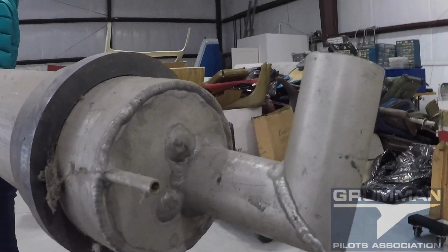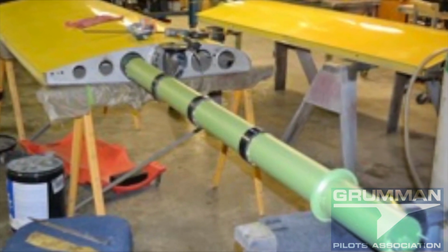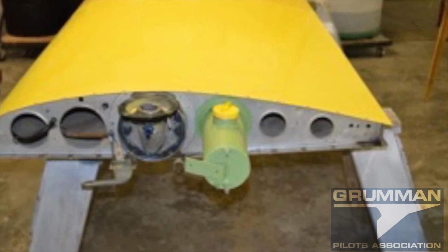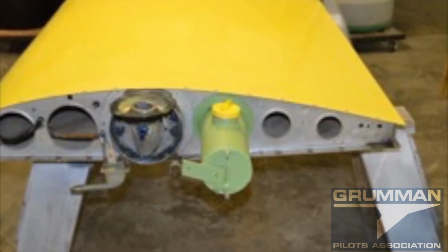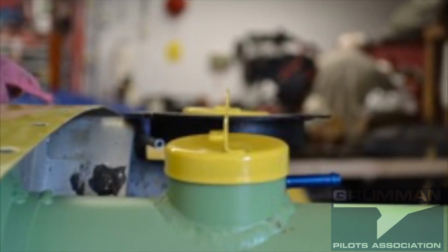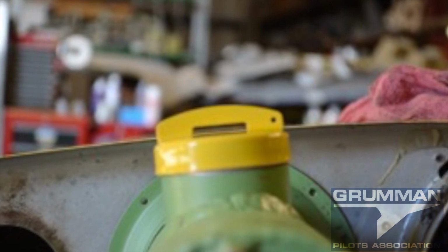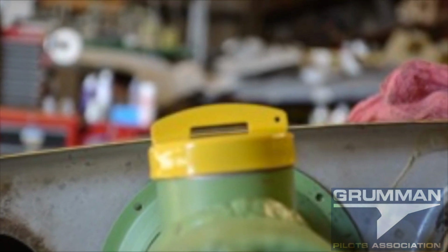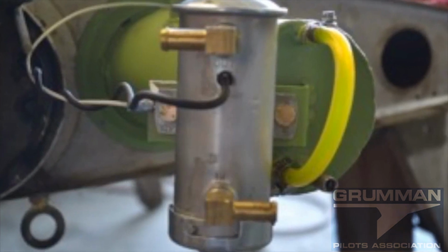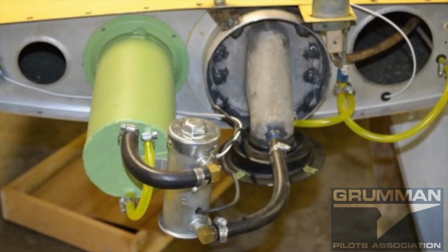And now let's talk about the Air Mods Northwest. Now here's an example of the Air Mods Northwest. They're painted a little different with a different primer, but they go into the wing the same way. Now the one difference with the Air Mods Northwest is you might have noticed a flange on the end of the tank, and this is for holding the fuel pump. They fit in the wingtip the same way as do the DMAs as for the fuel caps, but the Air Mods Northwest have a fuel pump which transfers from the tank into your main tank, and that's the difference.